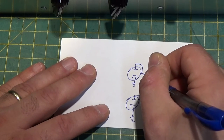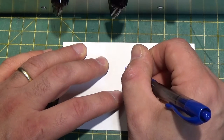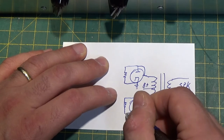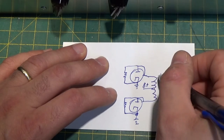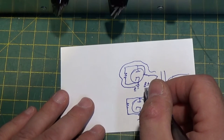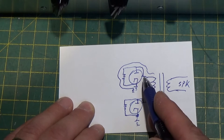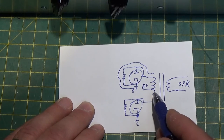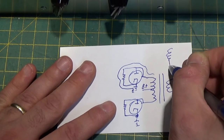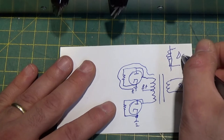And this would be your B+. Now, if you notice, these just kind of act like this. The vacuum tubes, when they're biased, basically act as a resistor, causing current to flow through the coil around here and around to ground. When I put B+ on here, it is a DC voltage. That DC voltage will flow this direction on this part of the winding and to ground, and this direction on this part of the winding to ground.